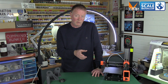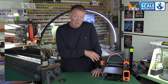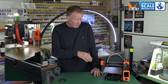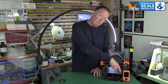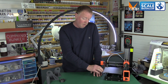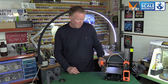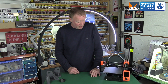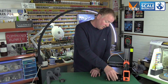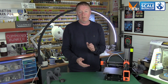I did the seven-point calibration and did about three first-layer calibrations. What I'm noticing is that one side is really low and the other side is really high, no matter how I calibrate it — up to a hundred-point difference. One side has filament that doesn't stick properly, and the other side is squished by about 20 points. I've taken the bed off, had a look, checked the screws — nothing is loose. So it's another faulty Mini. That's two I ordered on the day of release, turned up over Christmas, and both are unusable.